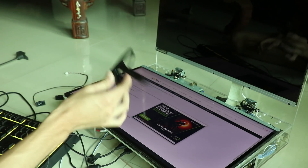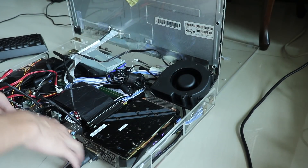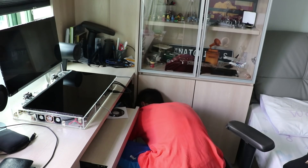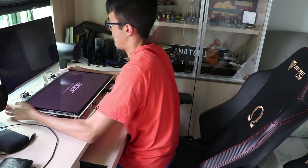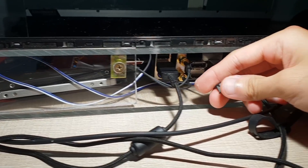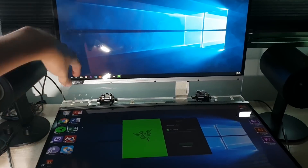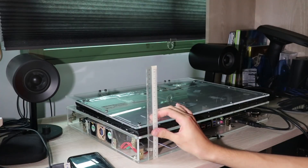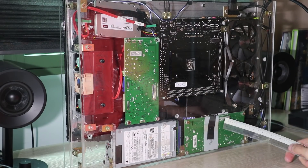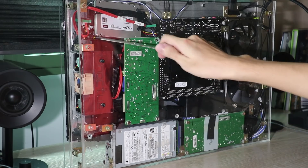Downloading the Nvidia graphics driver. I also added the WiFi receiver and some inbuilt speakers. I'll add a small blower fan to exhaust the GPU heat out, and the computer is finished. Sadly, I did not manage to cram in the keyboard and mouse, so it has to connect to the motherboard with the front of the PC exposed. The GPU hits 79 degrees Celsius running Furmark, with dimensions of 85 x 500 x 350 millimeters and a volume of 14.8 liters. The final case layout includes two display boards, power supply, motherboard, GPU, AC adapter for the screens, a modded AIO to cool the 1700X, and SSDs.